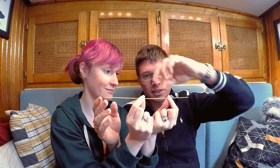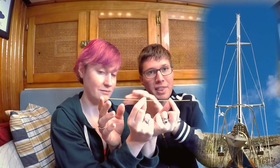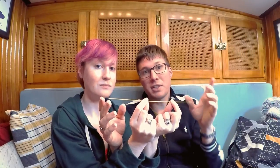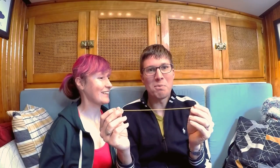That's the idea behind spreaders — they add little points that help break up the unsupported length. Every time you have a spreader, it's not just the spreader going there, but you also have a stay that terminates at the base of the spreader, and that helps break up the unsupported length of the mast. It's all triangles, and triangles are the most supportive shape there is in geometry. The more you know! That is the idea behind spreaders.